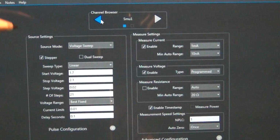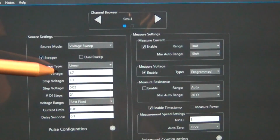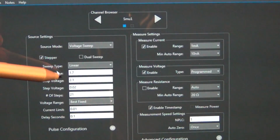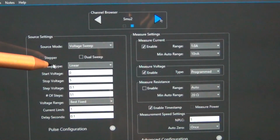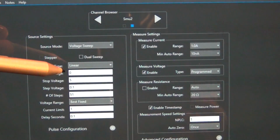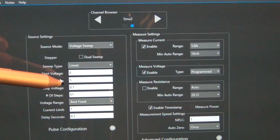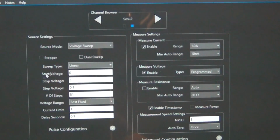And I have configured the instrument to go from 1.7 to 2.1 volts on the gate to source voltage. The reason I'm starting from 1.7 is because below 1.7 the transistor is essentially off. So you can measure the leakage current under that condition. I wasn't too interested in that at the moment, so I just set it to 1.7 volts. And on the second channel, the drain to source voltage, I go from 0 volts to 5 volts. This will take the device through the triode to the active region, because the VDS starts at 0 volts, that's in triode region when the device is on, and once it passes the overdrive voltage, it will enter the active region. So then in that case, we should be able to see the classic IV characteristic of an NMOS transistor as a function of VGS.